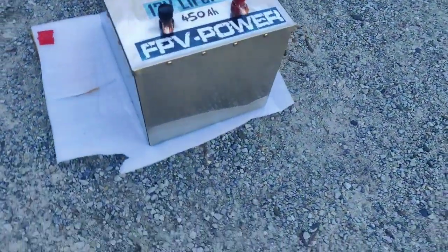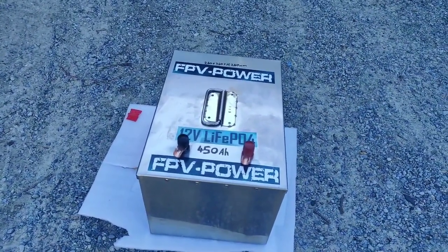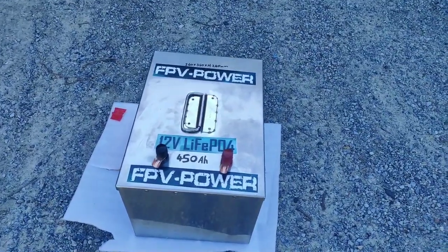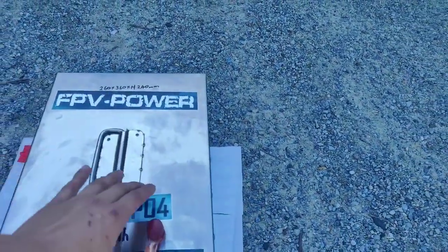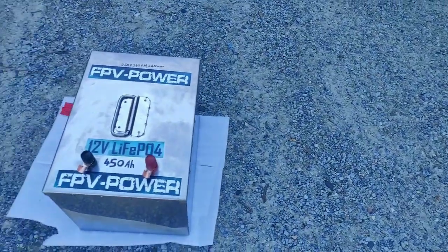So I'm putting that nice foam underneath so we don't scratch the beautiful custom build. Give you a quick run through on the comparison. He had 440 amp hour at 12 volt, deep cycle, and it weighs him just over 130 kilos, okay? And the space it took was one of this bay. Basically he had one battery there. He had two batteries for the same size. He had a 6 volt, 6 volt, 6 volt and 6 volt. So basically essentially he had two. The volume of this times two was what he had in his motorhome.